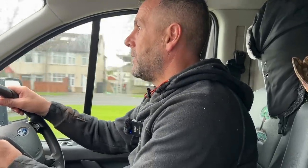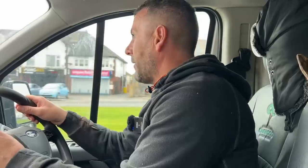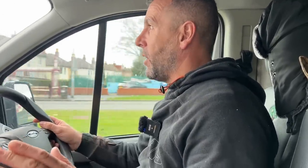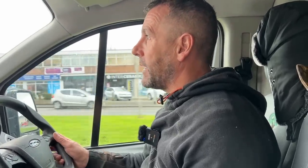Hoog 11 asks: have you tried a Dewalt Forstner bit 75mm instead of a chainsaw for recessing the top bolt on the floor frame? I know it would be neater, but it would be another drill bit I'd have to continually replace because it wouldn't last long. Being neat serves no purpose here - we have the chainsaw out anyway for cutting the ends of the 4x3. It might look rough but there's nothing wrong with using the chainsaw to notch them out.